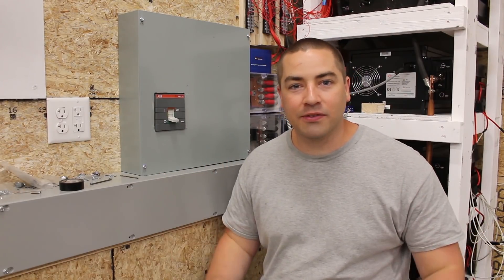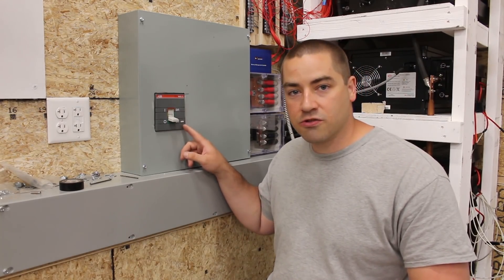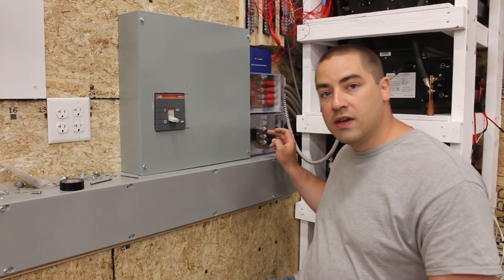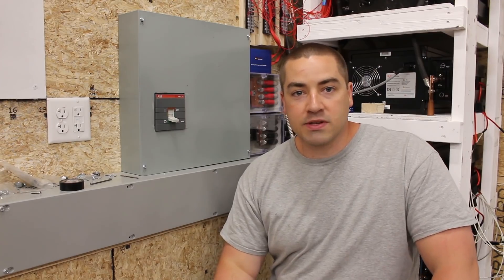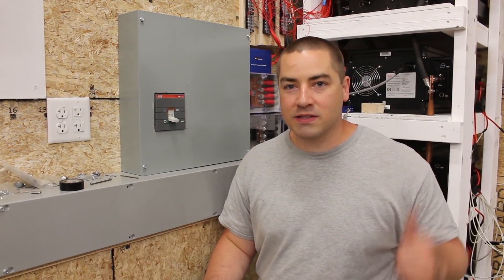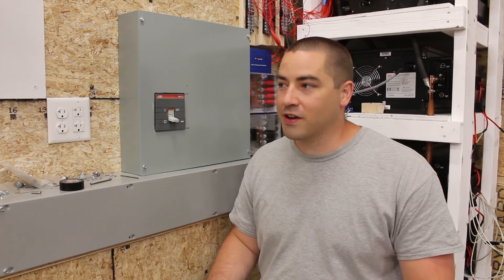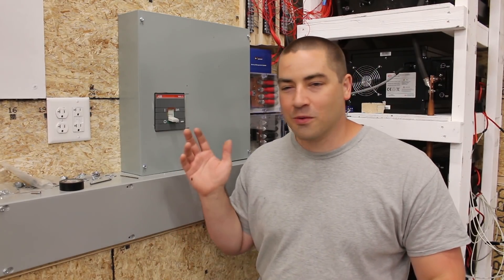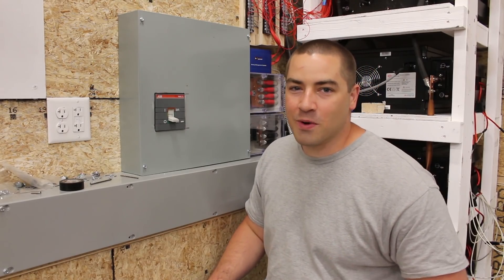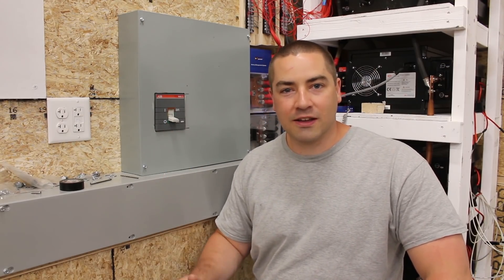We got a lot done and I would love to say it's 100% complete, but of course it never truly is. I still need to run the shunt trip wires to the BMS through a relay, and I have to calibrate the shunt for the BMS because the reading on the amps is completely off. I felt bad having to jump on grid power today, especially because the batteries are full and we could have used the inverters. But we'll jump on them now and keep on rocking the off grid. It feels so much better using power when we know that we've produced it on site — I just get giddy with the excitement of it. Thank you everybody for watching. If you enjoy the videos, please like, subscribe, comment, share, and check out some of the links in the description below if you'd like to help support the channel.